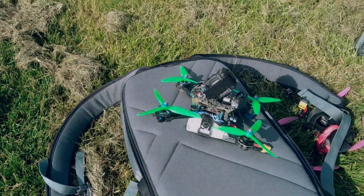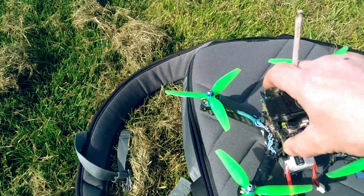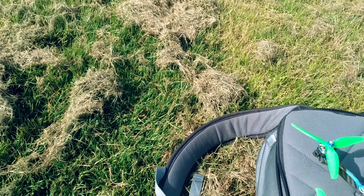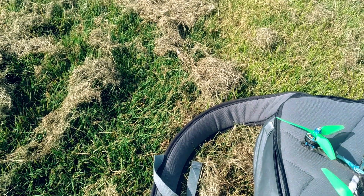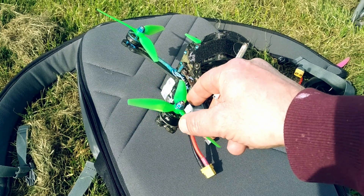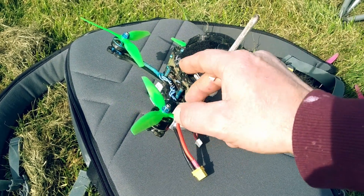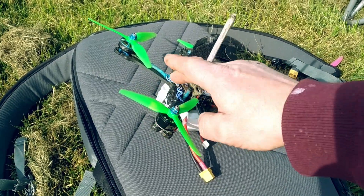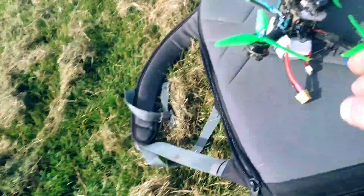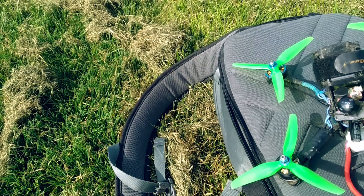Let's find out what happens when you run odd motors with motor output. I burnt out one of my normal motors the other day and didn't have any spares. The closest I've got is an old F60 Pro T-Motor — on the first edition that was the only spare motor I had. It's 2207 but it's 2500KV, and the rest of the motors are 2650KV.